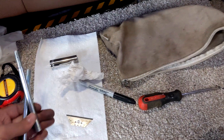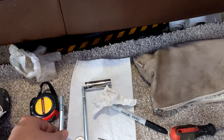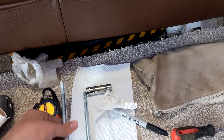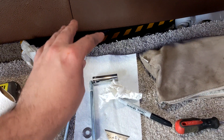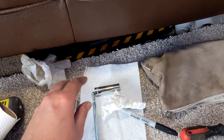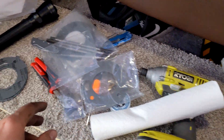What I did to help aid this process is I got two longer bolts and cut the heads off to use as guide studs. I screwed these into the head, slid the gasket and the manifold on, then started the other two bolts, got them snug, and backed these guys out to put the other two bolts in.